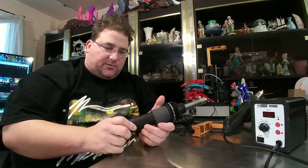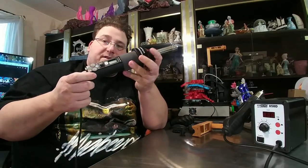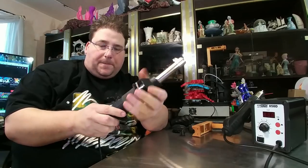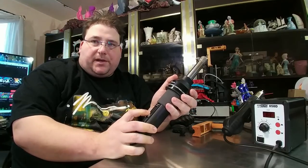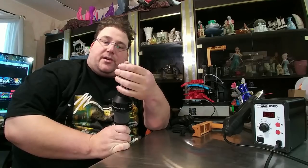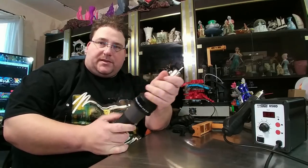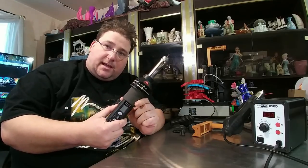Then Banggood sent me this one, which I thought was really slick because it's an all-in-one. This is a workstation — this is what you'd use at home, sitting on your work table. It's all built into the handle, so you can take it with you. It's 110-volt powered but all portable. You have two dials: one for airflow and one for temperature. It's analog but with an LCD display so you can adjust it as you see what temperature you reach. It comes with about five different nozzles for how much air you want to blow, or you can take the nozzle off altogether. More control, more precision — you can control both temperature and airflow. Pretty slick. I'll be playing with that.